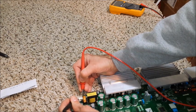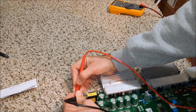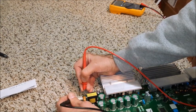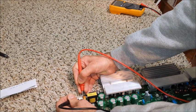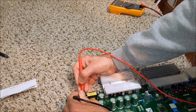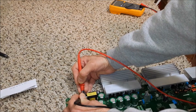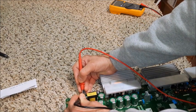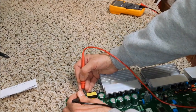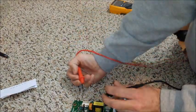So we've established that VS is fine. Now going to VA — we don't have any shorts between VS and VA. We still get that momentary beep if we switch the probes but that's fine. And then making sure we don't have a short between ground and VA. I just realized that throughout this whole thing my hand is blocking what I'm doing, so sorry about that — let's try this again.